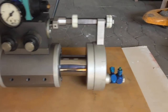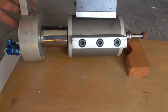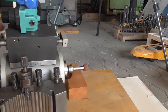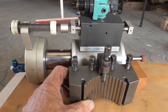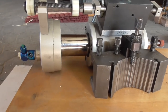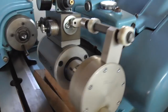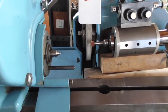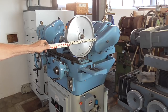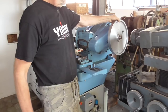You can adjust the axial travel. One of the purposes is regrinding the taper in mills — you can clamp it to the table and regrind the taper in a mill. But by chance it also fits into a Multifix holder, and then you can use it in the lathe to grind precision tapers or whatever you want. It fits in the cylindrical grinder, on the table of a mill, or in the lathe.